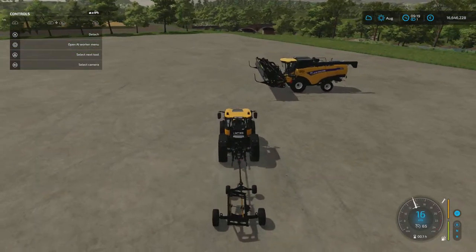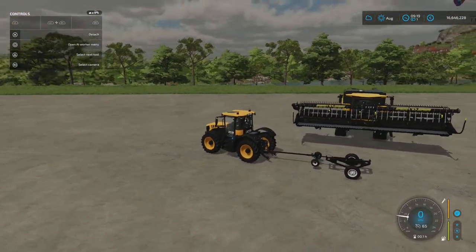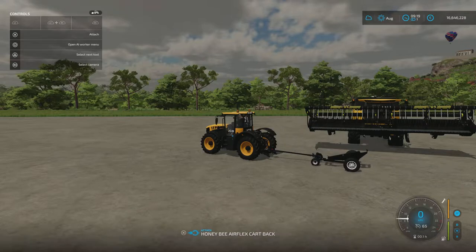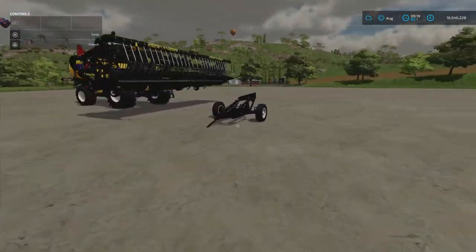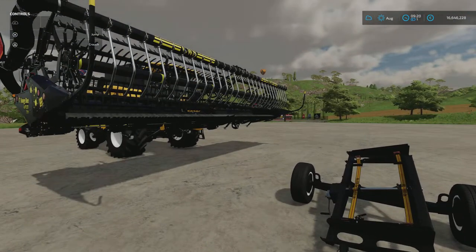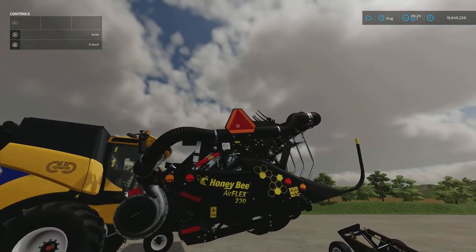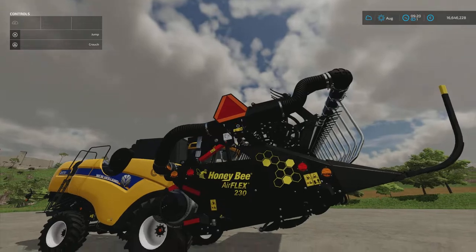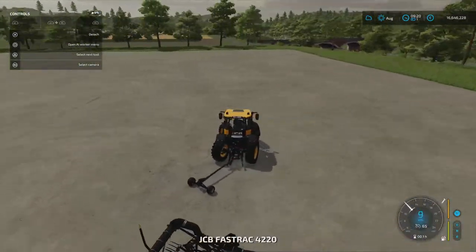We need a vehicle to bring it with us, so we come up front of the header like this. I like to judge it just past the connection to the harvester, usually around where the wheel is, and we just drop off that little piece at the back. Before we do any more, this needs to be slanting towards the header, but also pointing towards the back — you know it's the back of the header by the warning triangle. So just bear that in mind: back of the header, warning triangle, slanting towards the header.